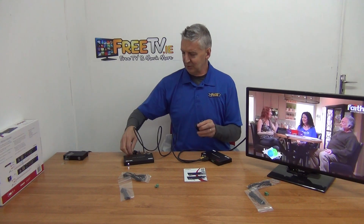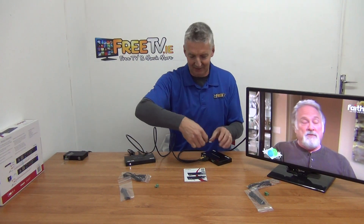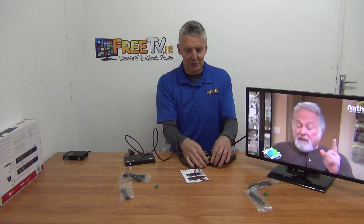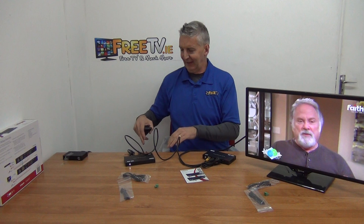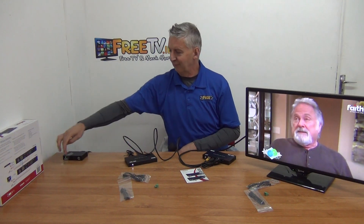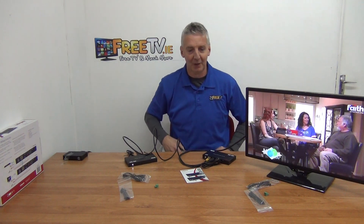On the receiver unit, we use these tiny IR sensors. The IR in sensor gets a small sticky pad and is mounted on top of the television. When you grab the remote control and aim it at the TV, the sensor picks up the signal, sends it into the receiver box, back through the LAN cable to the transmitter, where it splits back out as an IR signal. We position that IR emitter in front of the set-top box's IR receiver — right where you'd normally point the remote — and all of a sudden the signal from the TV location runs through the network cable and changes channels on the box at the other end.